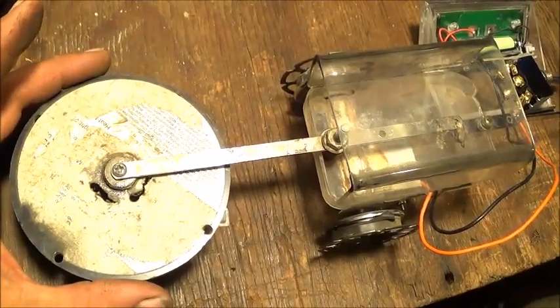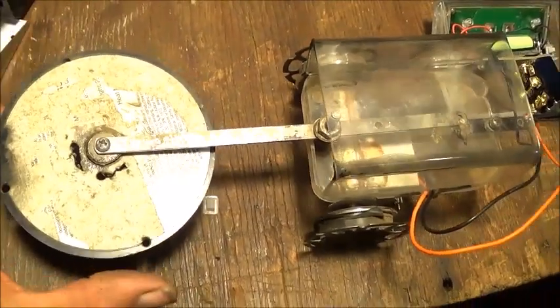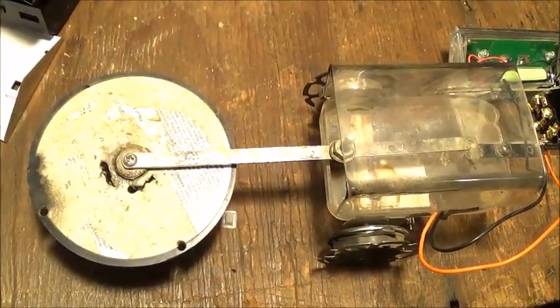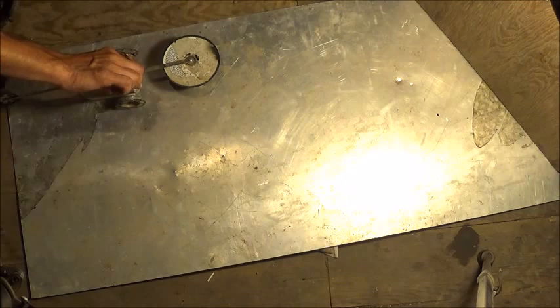Your roller wheel needs to be at least the same width as your bot, if not just slightly larger, to allow it to impact right against a wall. That will allow the tire to move correctly so it will pull itself out and away from the wall. So we're going to do a real quick wall bump test — just turn it on, let it hit the wall, and see if it turns.